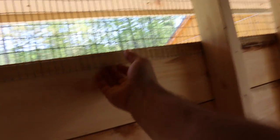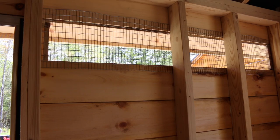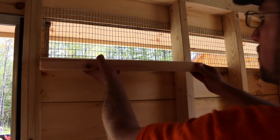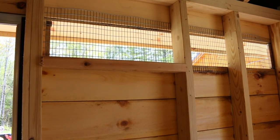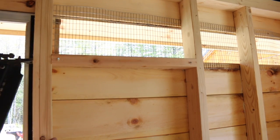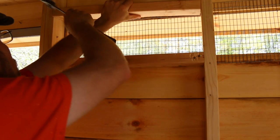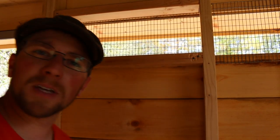Right here the bottom wire and top wire are a little loose, so I am taking some 2x4 framing straps that I have left over and just putting them in place and nailing them. Kind of making a picture frame — not because we need it for strength or anything. We are just doing this so we make sure no critters can get in this thing at night. I'm just gonna repeat doing that for the rest of these little windows. Awesome guys, we got them all framed out. Now come wintertime we can put plastic or glass over the inside and outside and it might help insulate and keep the cooler air outside.